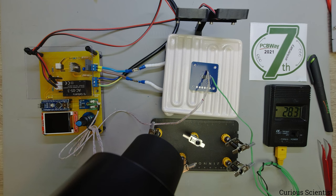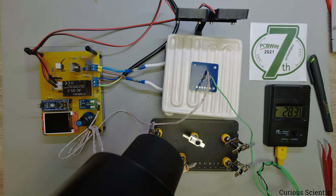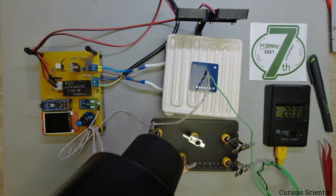Since I couldn't arrange the wires nicely for this experiment, the view won't be 100% perfect but you'll see the most important things. Everything is done, so I just have to turn on the power supply and start the program. When I turn on this thing there will be a welcome message shown for five seconds, during which the fans will turn on as a startup check - if the fans run while the welcome message is shown, things are more or less in good shape.